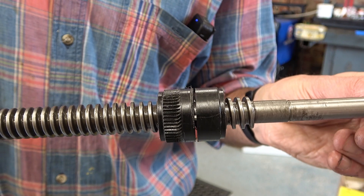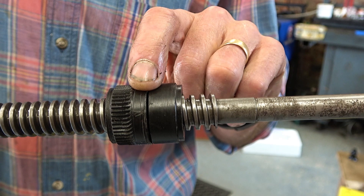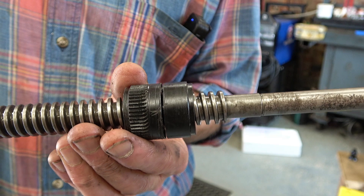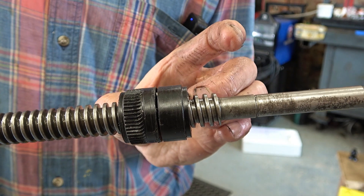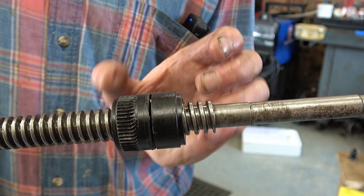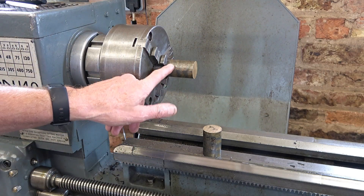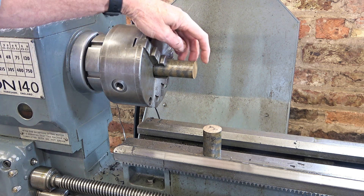That's done. I didn't quite get the indexing right — I've got a little displacement between one mark and the other, about a quarter turn, so they're a bit closer together than I planned. I'll have to watch that when I do it in bronze. But otherwise it works: turn this one and it's locked to this half, and if we squeezed either side on those pins it would squeeze together and take out the backlash. As a prototype I'd say that works. The job now is to repeat the whole thing in bronze — I'm going to use the longer piece, machine the outer to make the blank, and drill it through the center.